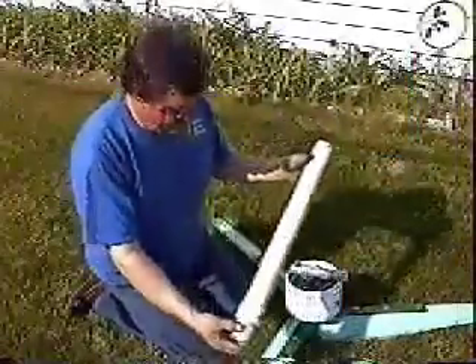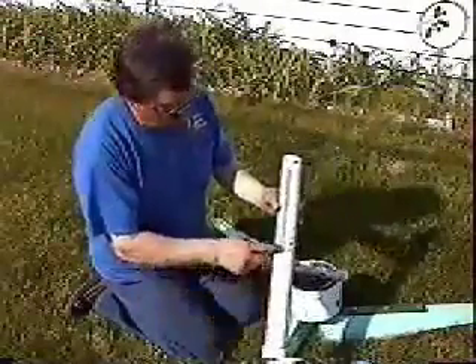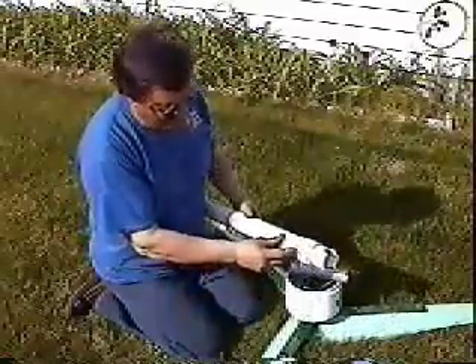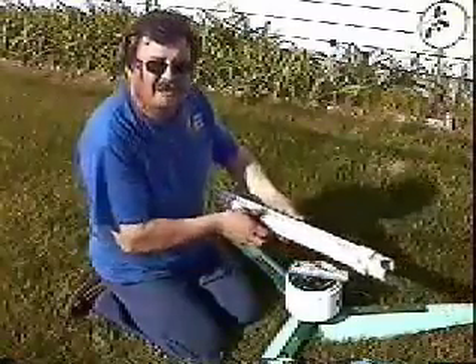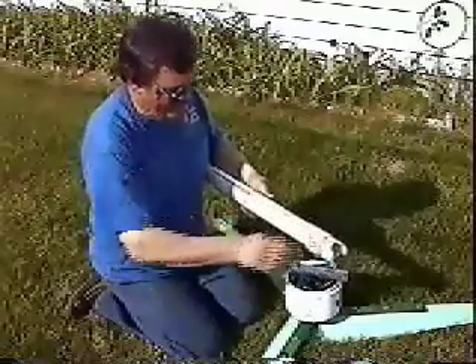The tail is made out of a piece of 2 inch PVC pipe — a quarter inch slot, the width of your tail, whatever you'd like. And a coupling, a 2 inch coupling that will slide completely over the pipe. If you've got to hollow it out a little bit because sometimes there's a little ridge in there, make sure that slides out.